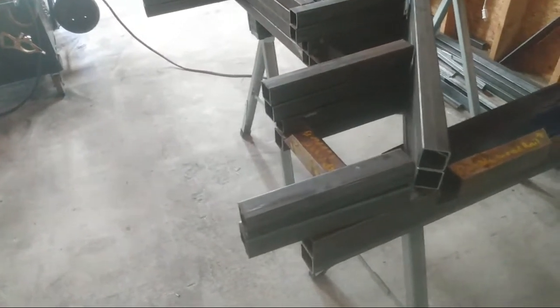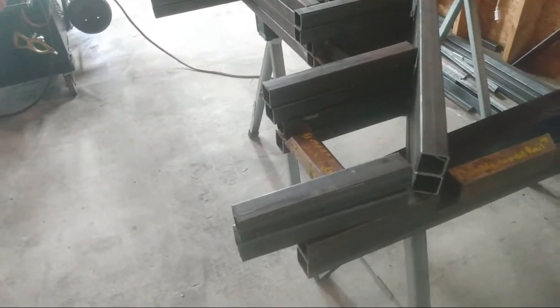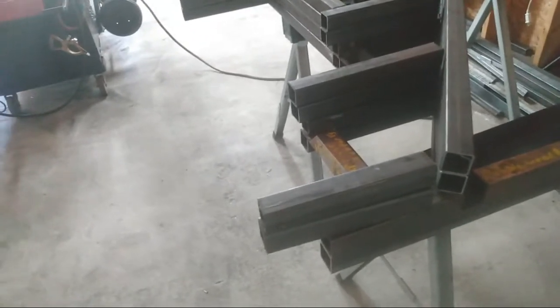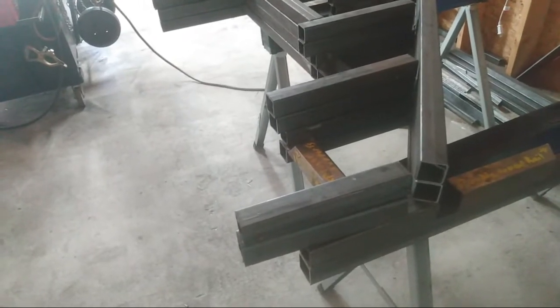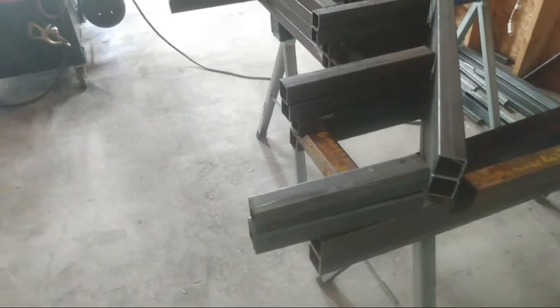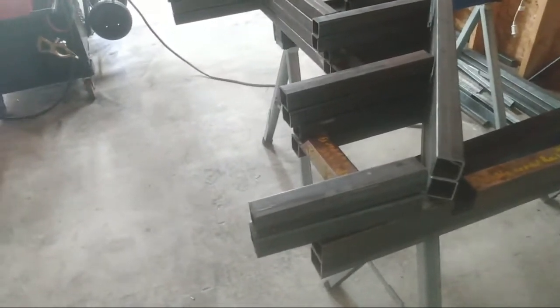Yes, because sometimes, as far as your staircase allowance, you can Google that too. It'll give you the national handrail standards, the national step standards. Step standards go between 7 and 3/8 inches and no more than 7 and 3/4 inches. You can have some custom ones, can be 8, but it's not really recommended unless it's custom.